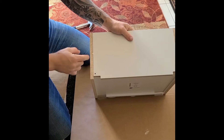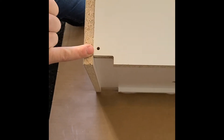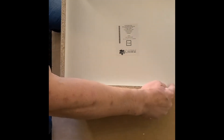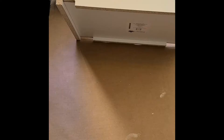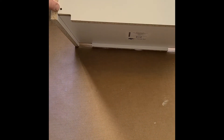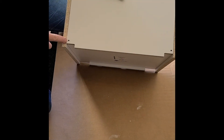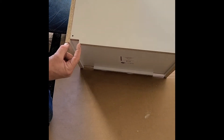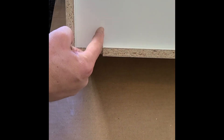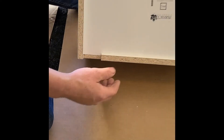You can see the back — where the back of the slide goes into, you can see where the clip mounts. The back of the drawer box has the holes for the notch or the clip on the back of the slide itself. The smaller width is for the slide itself, and the wider width is for the clip to mount into. So you definitely know what the front and the back of the drawer box are.